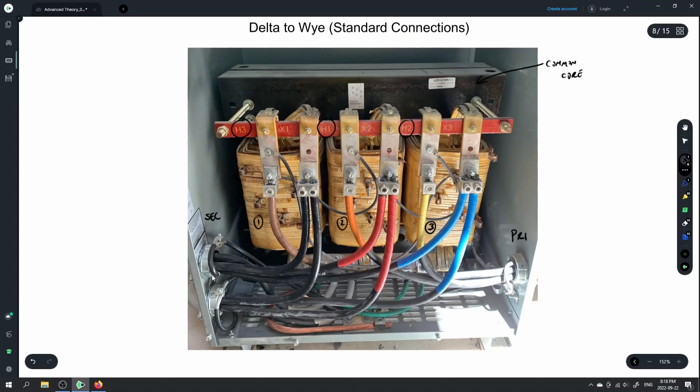Because the voltage is lower, the current is going to be higher, so we need larger gauge conductors for that. We've paralleled the A, B, and C phase out, and we've also done double neutrals — parallel neutrals as well.